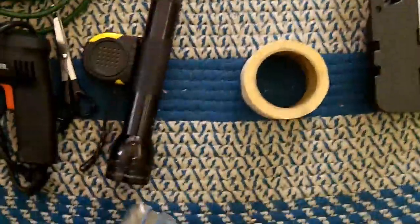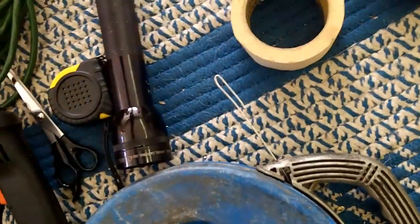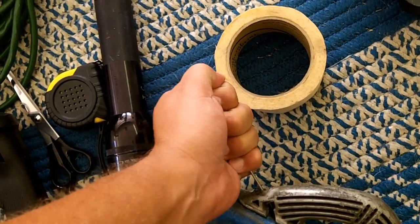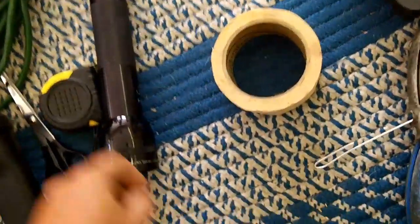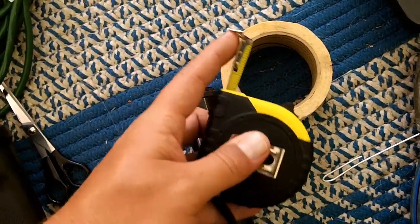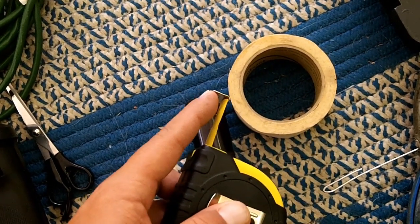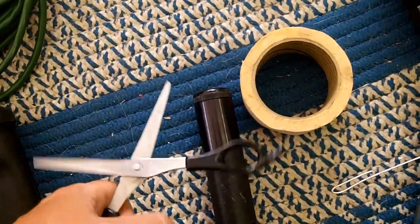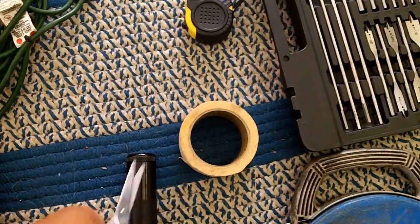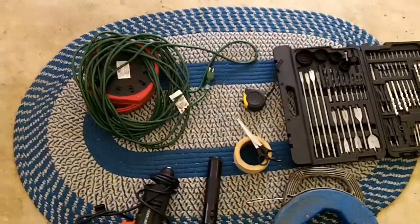Another thing you're going to need is fish tape — it's just a steel or metal rod that you pull out and fish down walls. That's what the masking tape is for: you attach your ethernet cable to it, mask it all together, then stuff it down the hole. You'll also need a flashlight, measuring tape to measure the cable — mine are eight-foot walls, so I measure off eight feet at the termination point, cut it, and stuff it down. Scissors work great since you can cut ethernet cable and masking tape with one tool. Obviously a drill and extension cords too.